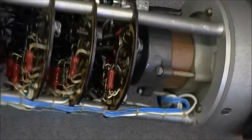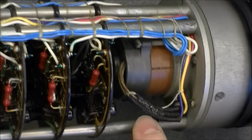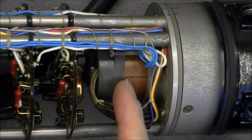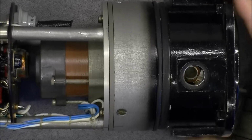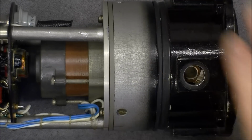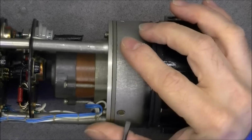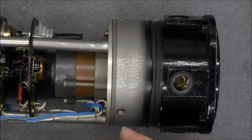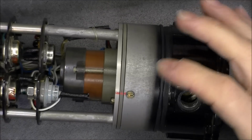Okay, here we have the main actuator for the needle, it seems, needle indicator. We have 3 wires going in it. Here is obviously a metal core for the motor, some kind of motor. And we have the front piece, which I need to unscrew in order to see what there is inside. So this one, again we have brass hardware in here. So maybe it is quite sensitive to magnetic perturbations, and they did use a lot of non-magnetic hardware.